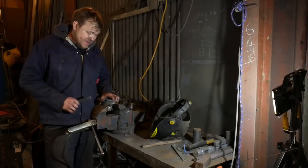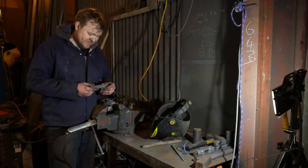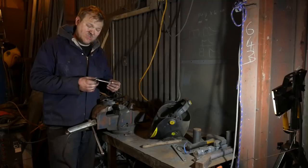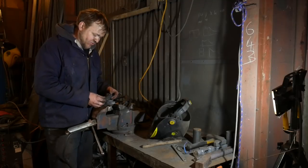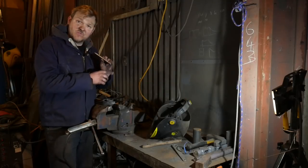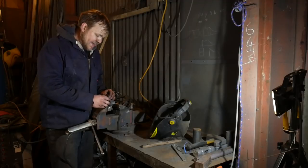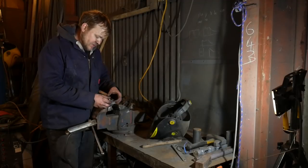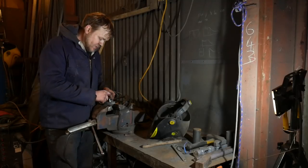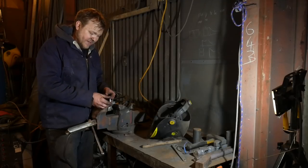The mess has been made — I've got a straight line and a scroll, and I'm reasonably happy with it. I've got a piece of 25 by 8 which is what we're actually using to make the scrolls out of. I've cleaned off the scale from the bottom of the jig and from the bar, and now I'm just going to weld it across as many contact areas as possible to give it rigidity so I can hold it in the leg vice.